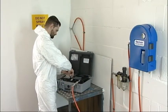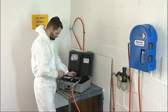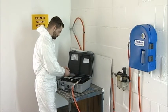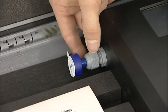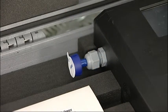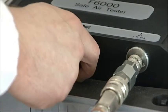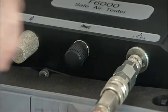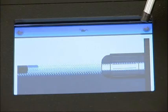Once the purge has finished, the Draeger impactor should be inserted into the test port and tightened firmly. Ensure the impactor has an intact protective seal — this seal must remain in place for the duration of the test. During the test, the flow meter should be set to simulate the requirements of the RPD. Press the button in the top right-hand corner to start the test.